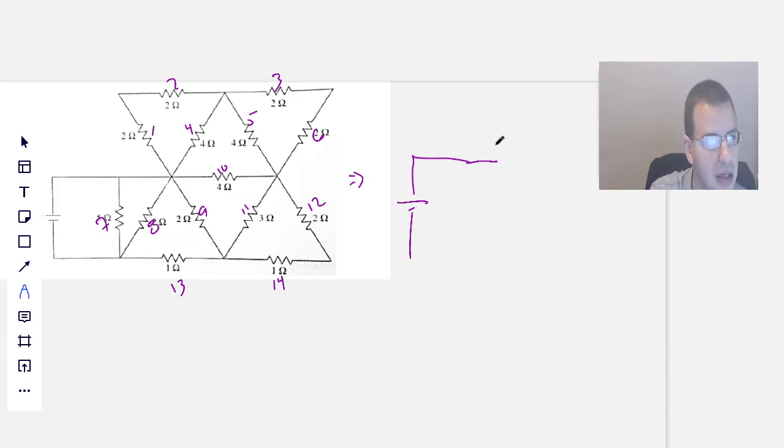That is many resistors. We have a branch that comes off, and this is 1 and 2. When they come together, that's 2 plus 2, which is 4. Right here, that's resistor 1, 2. I should write that as R1,2, which is going to be confusing because now it looks like R12, but you're going to see where I'm going. And that's going to be in parallel with R4,